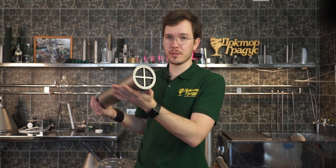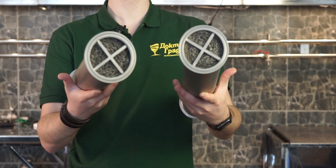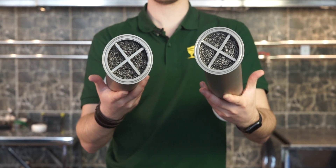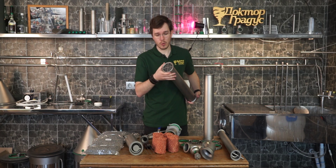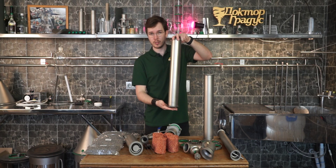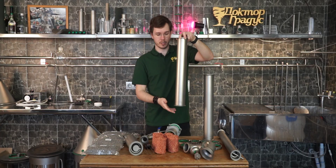In the bottom of each extension a stainless steel cross is welded. These are for holding SPP packing inside of the extensions. There is also one roll of stainless steel mesh in each extension to hold the SPP, so vapor will rise evenly to the packing of the extension.